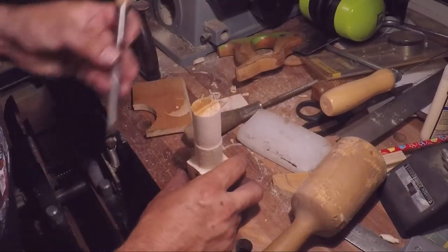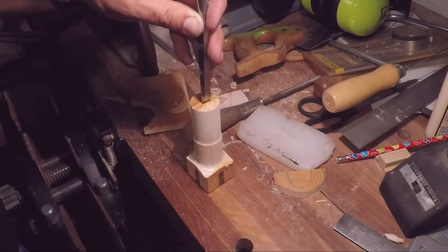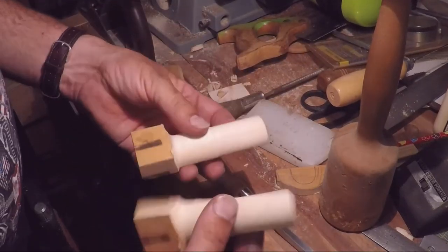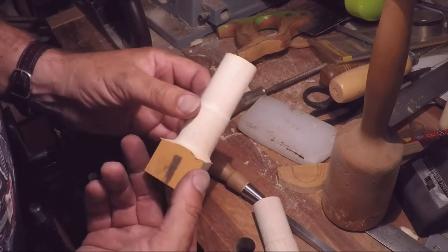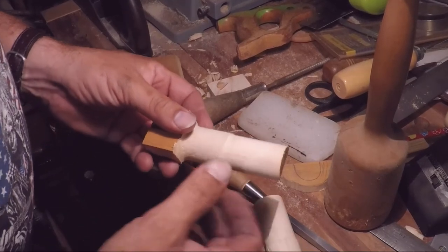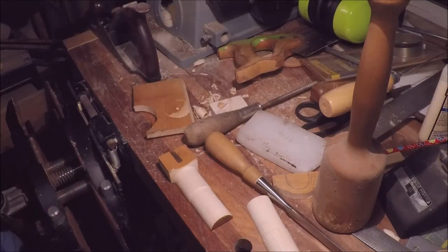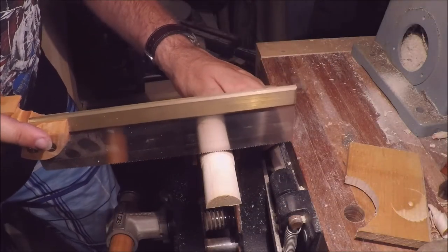Here's the moment of truth - I always feel like it's not gonna work, but it should work with no problem. There we go - split in half, nice and pretty. Now we'll just take it and dust it on the sander. I'm going to cut off a little bit - there's a little radius there that'll help with transitioning into the back end of the pattern. It's always nice to have radius in there anyway. I'll leave this thing long on purpose and trim it off later.